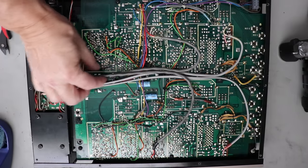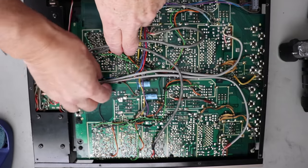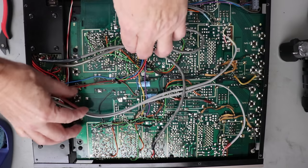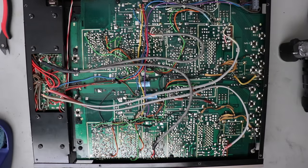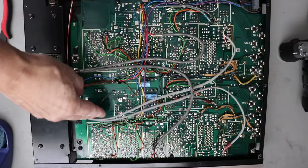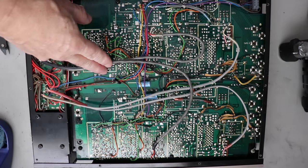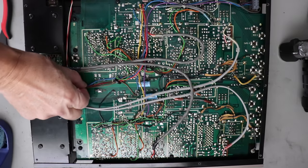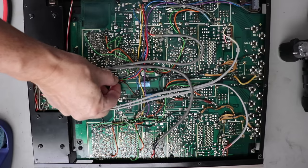And I can tell you from experience, you want to do that, because you touch your soldering iron or that desoldering tool on any of these pieces of insulation on these wires and it just instantly melts it. See, this gives me some more slack now. It's only two cables that are like that. It looks like there's some small wiring here that's also down under this little holder.